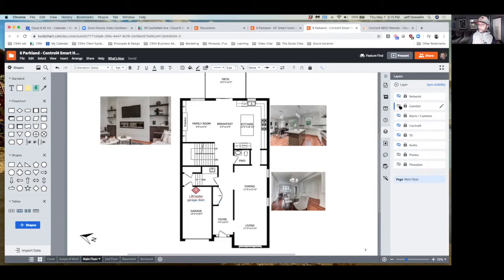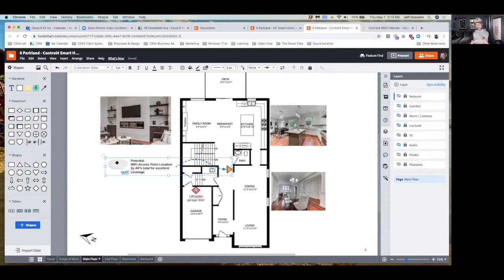To make all this work you need network access points. These little devices mount to ceilings and walls — about the size of a dinner plate and about an inch thick. They're powered by a switch in your rack and use your network cabling, which is why we had you walk around and show us all the network cables. The one we're hoping to use — I have a feeling based on where it's located it's actually wired for a doorbell chime, but it could be Cat5 or Cat6 we can use for the network. It's not a bad spot closer to the kitchen because you can hear it going up and down the stairs.